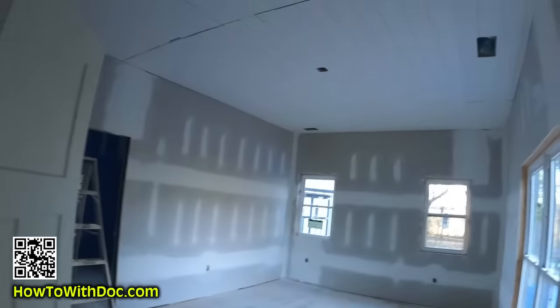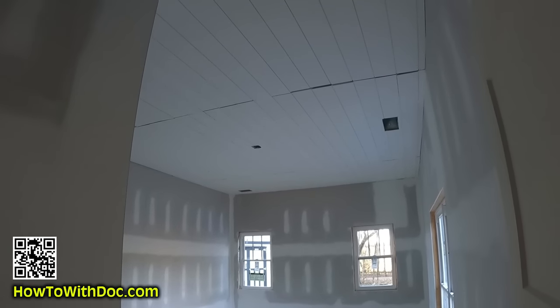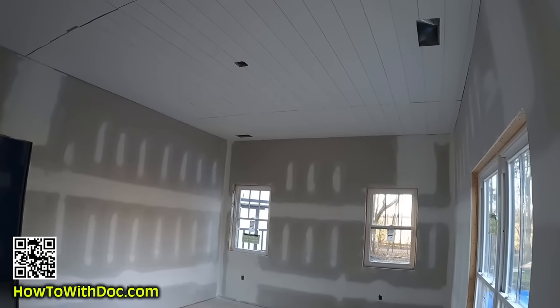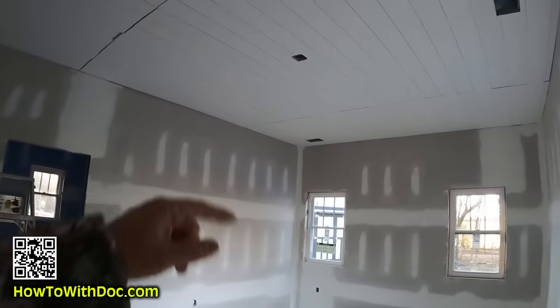The master — which was an old nasty garage — is now done. You can see all the shiplap is up on the ceilings, and we're going to put beams here and here. We're just going to bolt the beams up so if I ever have to do any kind of repair work on the ceiling, I can unscrew those beams, pop off the shiplap, do my repair work, and pop it back. Don't extensively glue — we're using just a little bit of contractor adhesive.